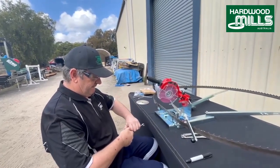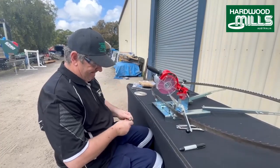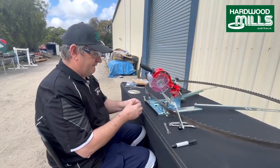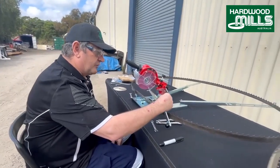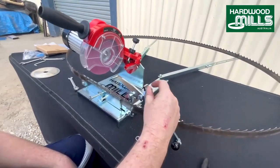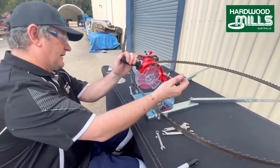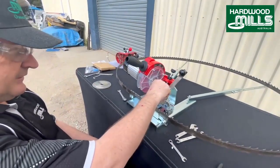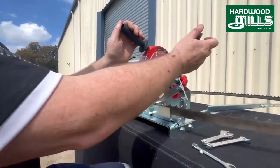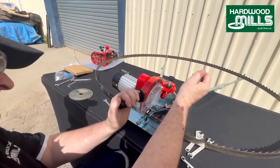So I'm just going to take that locking nut off the front. So we're just going to do every step on this. Okay. So just going to screw this in here without the locking nut at this point. And we're just going to index this. So it's winding in. We'll get it roughly where we want it. You just a couple of clicks. Yeah, we're getting there. Now here, you can hear that scrape. That's probably a little bit too much. You always confirm with a couple of clicks. So we're just going to take that back a turn. Yeah, it's not too bad.